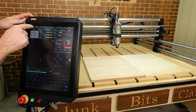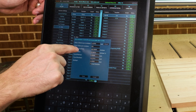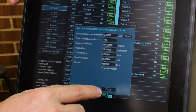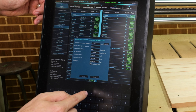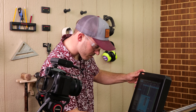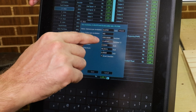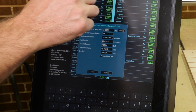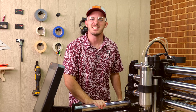We're going to have to go into settings real quick. Go to setup, click the X-axis — the maximum feed rate is 400 inches a minute. So I'm going to set it at some ridiculous speed: 1,500 inches a minute. Now it can run faster; the max feed rate is set a little bit higher. Next up, 600 inches a minute, baby. Let's go.